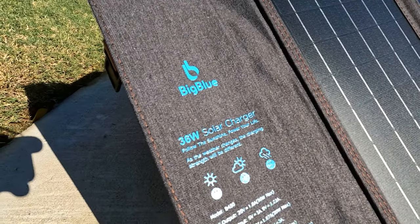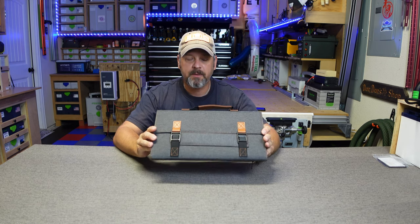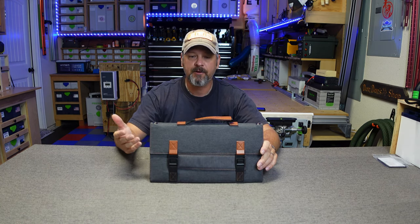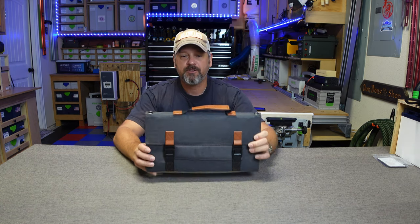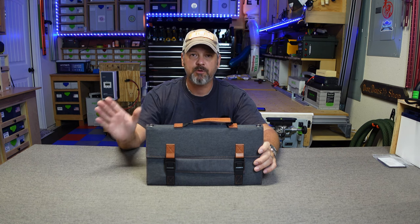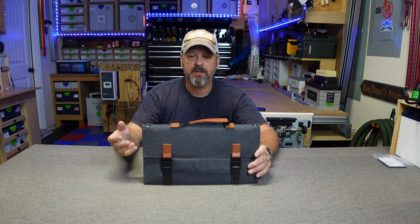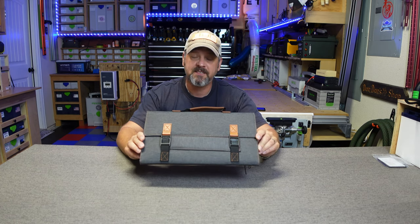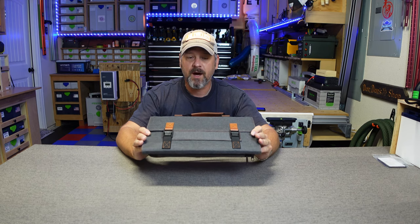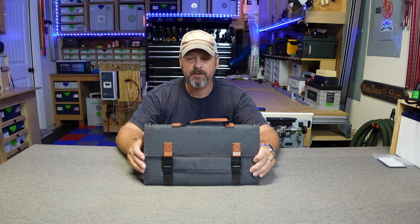It's rated at 36 watts and overall it works pretty well. Keep in mind this is mainly geared to charge up phones, small tablets, or perhaps drone batteries — it is not meant to charge up battery power stations or a 12-volt battery, so don't expect a huge output number. This is meant to throw in your backpack and not even know it's there. On a decent day it'll put about 24 to 25 watts into your phone depending on what your phone can handle. I'm impressed it hit 24 watts because I was testing at 9 a.m. with the sun just coming up over the horizon — not perfect conditions — so 24 watts off a 36-watt panel in that scenario isn't bad.